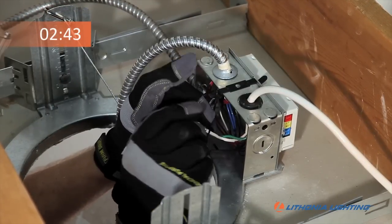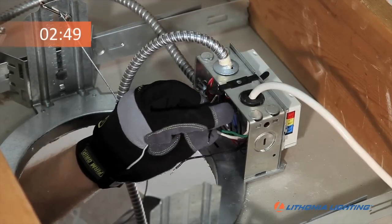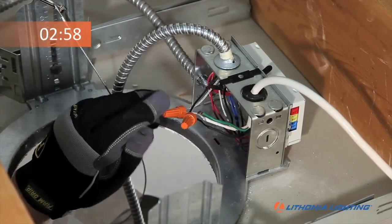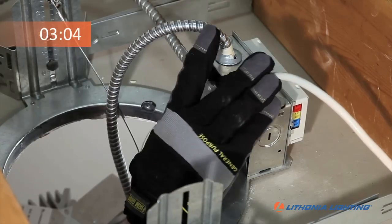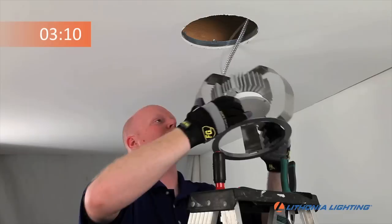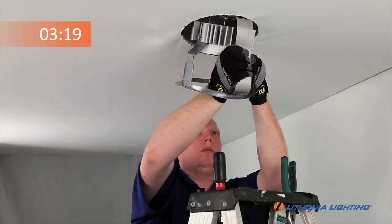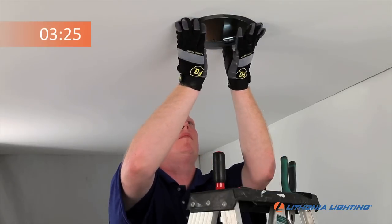You'll make two wiring connections to the black and white input leads. Then reinstall the junction box door. With both hands, grab the vertical supports compressing two of the springs with your thumbs. Lift the fixture into the aperture and then reach in and grab the third spring, pulling it forward to maneuver the fixture up and into the opening. Push all the way up against the ceiling.